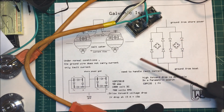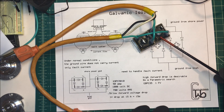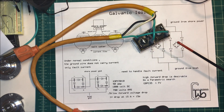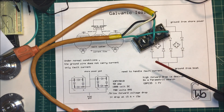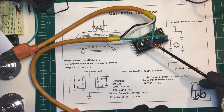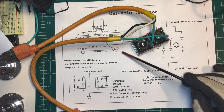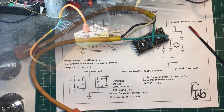I'm going to try this outside — I'll short it out and see if it will actually handle the fault current on a dead short and trip the breaker. That's a simple galvanic isolator and it's easy to make one yourself, or you can buy a factory-made unit designed for this situation.